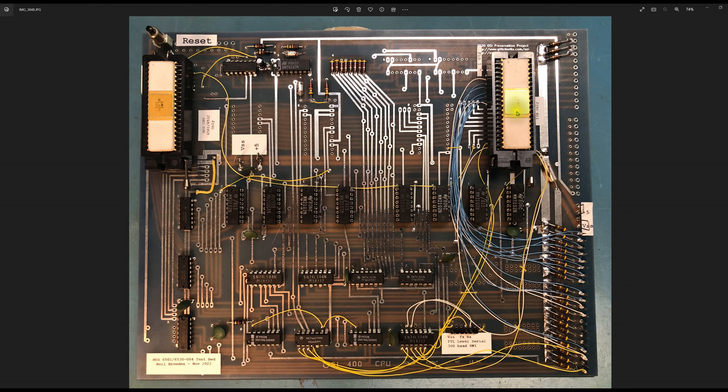There's a heavy wire bringing +5V down for these components, and some jumpers dealing with power rails. You can put a 6512 in this socket — it's nearly pin-compatible with the 6501, with just a couple of pins not compatible that are left floating in my configuration. I did all my initial testing with the 6512 in place. If I blow up the 6512 I can get a replacement; if I blow up the 6501, that's a real problem — we saw two of them sell on eBay for about $5,000 apiece.